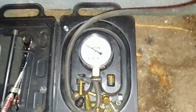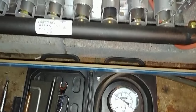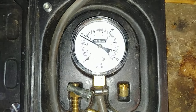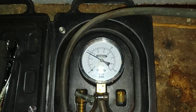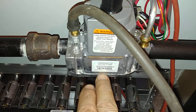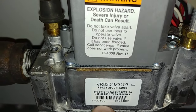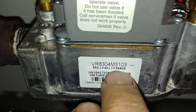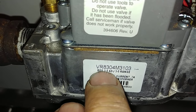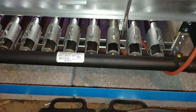The pressure at this inlet tap dropped pretty far — that's four and a half inches, which is minimal. This valve is designed to put out three and a half inches, and it can be adjusted between three and five inches of water column, but the maximum that should come out is three and a half inches. That's kind of standard.